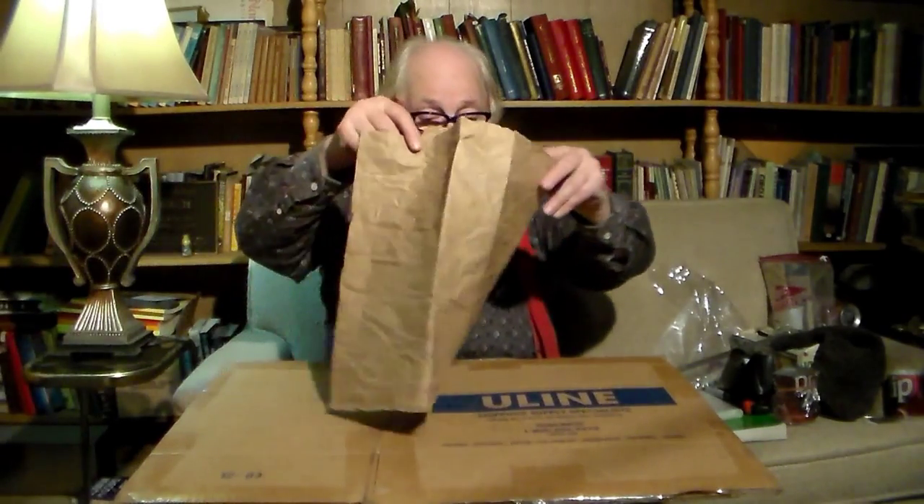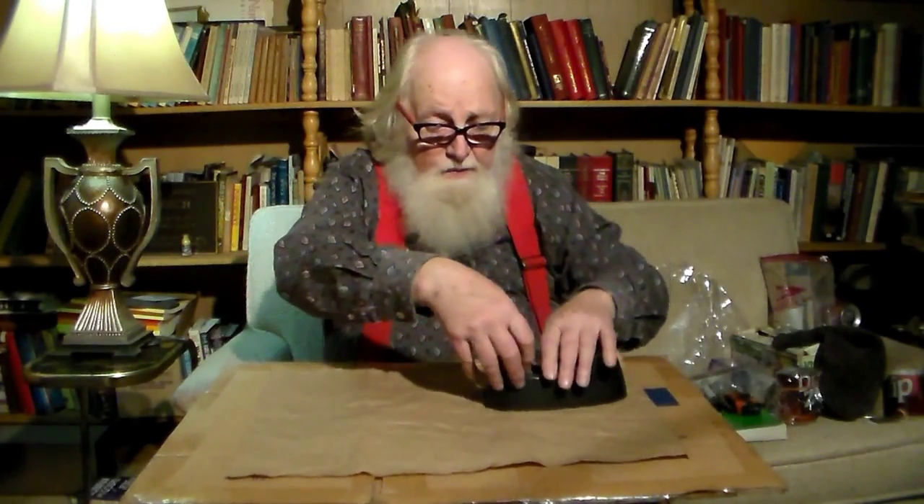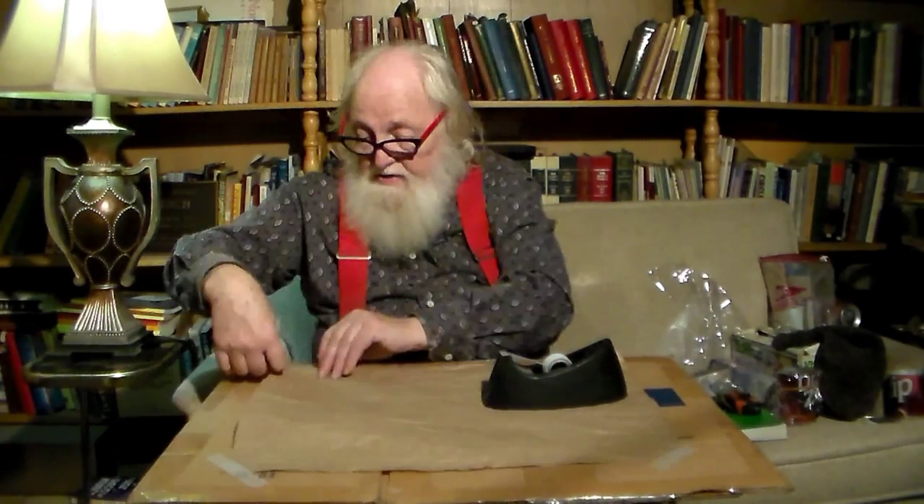One new trick I had to learn is how to make those filaments today, because you can't go to the wife's sewing drawer and get a piece of thread or fishing line — everything today is anti-static. But we make them out of these garment bags, and I'm going to show you exactly the detail of how we do that, because that's the trick. So, Gemma Dog, what we're going to do is now show people how to make the threads used in the Kearney fallout meter. We have a work table here. We put a piece of cardboard on it, and on top of the cardboard we put a piece of brown paper. We then tape it down to our cardboard — this gives us something to cut into.